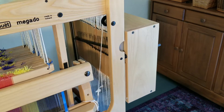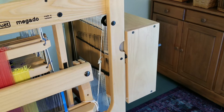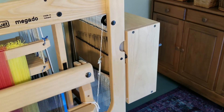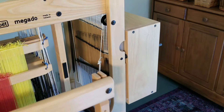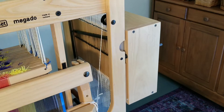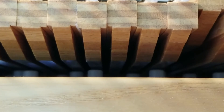This is the interface or dobby box. It is activated by releasing the treadle. The dobby hooks are pushed out for each shaft that needs to be lifted by a solenoid from the dobby. The long black knife catches them and pulls down on the cords that lift the shafts. Here is a close-up of the action of the solenoids from the dobby, pushing out the dobby hooks so that they can be caught by the knife.